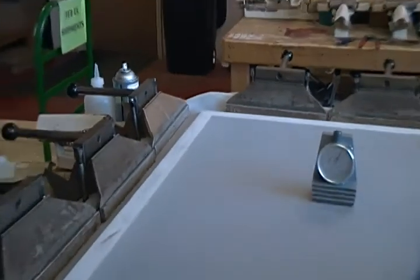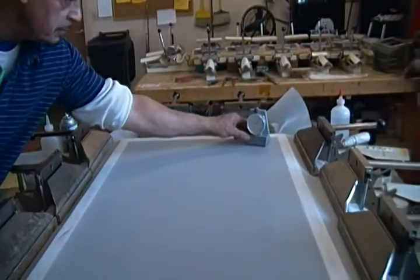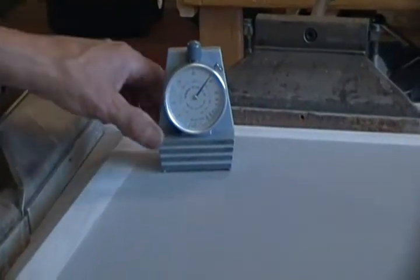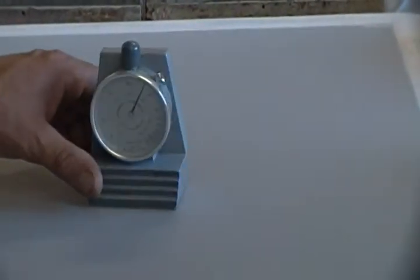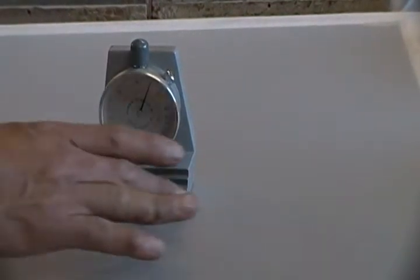At this point, we'll take a look at the newton meter in all four corners, looking for a hot spot or low spot. We want to be within 2 to 4 newtons of the 26 that we brought it to. Then we take it back in the middle and ping the screen one to two times to make sure that we have the best reading. At this point we take the newton meter off the screen and put it in the case, because it's an expensive tool.